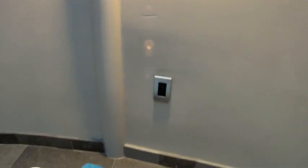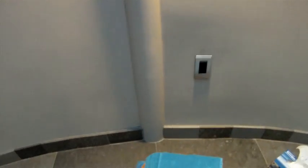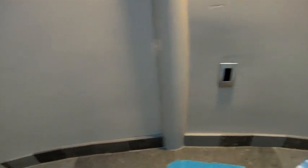Now, the thing you have to be very careful of with sponges, and that was just a little piece of sponge, is that with a sea sponge, they could have sand stuck in them, which obviously wouldn't be very good, to have a nice fat piece of sand go across your mirror surface. So I spent quite a bit of time soaking these, wringing them out, drying them, soaking them again, just to be extra sure. I mean, they wash them when they cultivate them, I assume, but just something to keep in mind if you do decide to go with the sea sponge route. Be very, very careful about them. If you haven't washed them, give them a good rinsing or two, just to make sure you get any sand that could possibly be in them out. And go over them with your hand too, just to see if you feel anything. Shake them out a little bit so that you have a level of confidence with them.